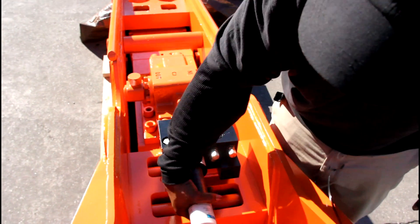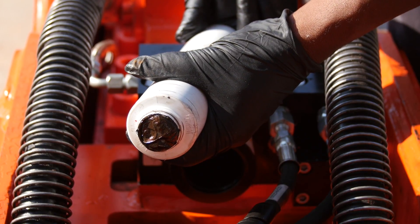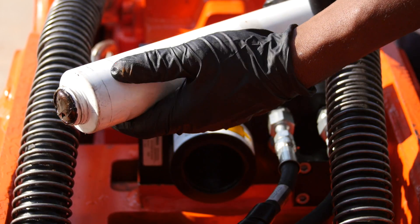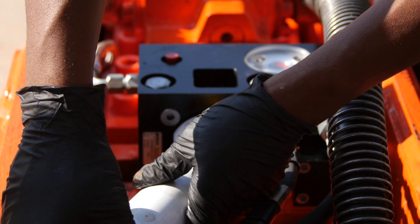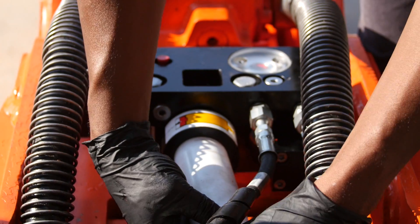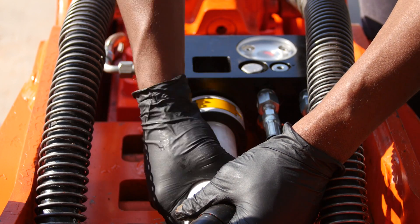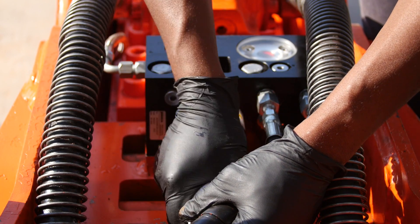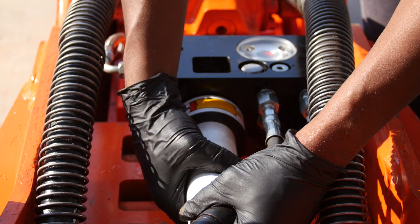To accelerate priming, first remove the cap from the cartridge opening. Then, using the cartridge follower piston, press the grease out 3/16ths to 3/8ths inches, which is 5 to 10 millimeters. Failure to follow this step may result in an airlock situation, causing the greaser to no longer pump grease. Next, insert the cartridge into the pump housing by pressing it slightly, then threading it in by hand. Do not over-tighten, as over-tightening will damage the flat seal.